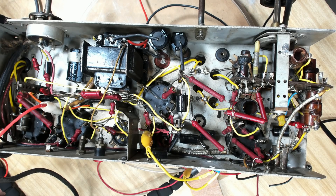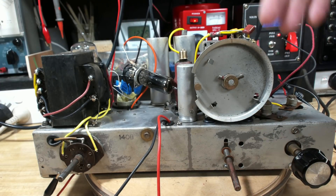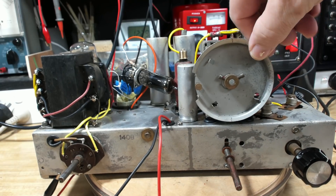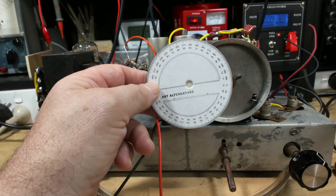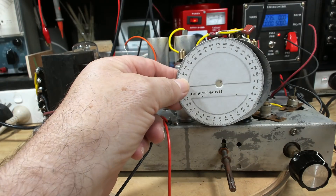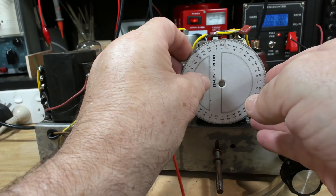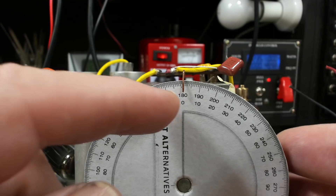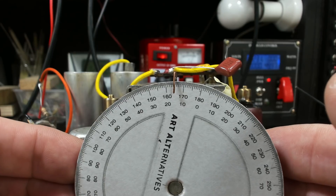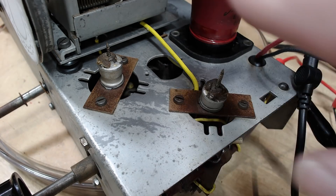The next stage is the RF. This radio is pretty unusual — you don't need the dial or scale on the front to adjust the RF. All you do is use the wheel here. To set it up, you open the capacitor all the way to fully open, then measure 15 degrees of movement towards closed. I've made a little protractor and I'm going to glue it on there, and I've also put a little pointer on it. This one's the oscillator and this one's the antenna.